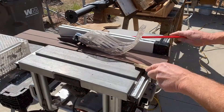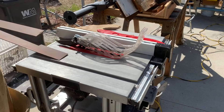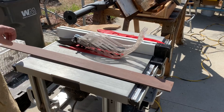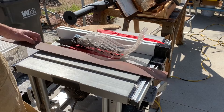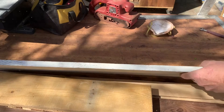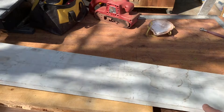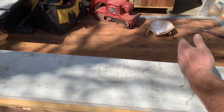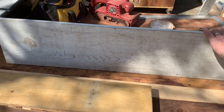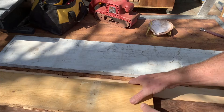I always wait till the blade stops spinning before pulling it out. Now I've got some nice even dulcimer sides and some stock for the archtop build. Here's the shelf for the top and back — I'm going to cut pretty much in half and glue the halves together. Then I'll have two plates for the top and back and I've got to carve them into the arch top. I've got some palette wood for the neck here.